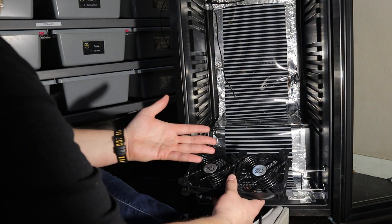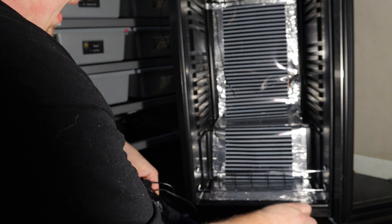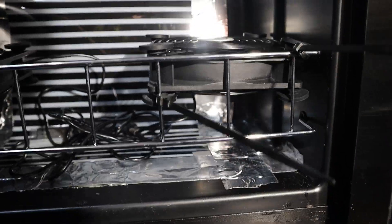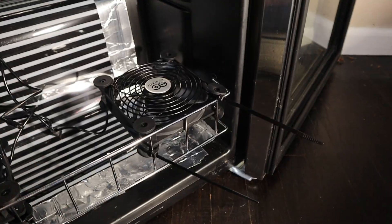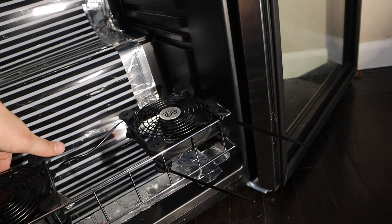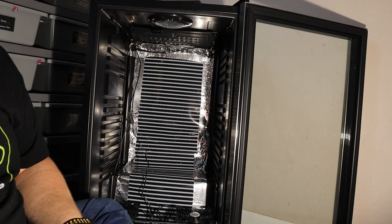The logo is pointing where you want your flow of air, so one will go up and one will go down. I'm going to point the sides with the wires inward so it's easier to run these out the back and conceal them. We've got those fans mounted — they're a few inches off, nothing special, just got them zip-tied in to this piece here. We should get airflow below and above and hopefully circulate that around. Let's run our USB wire for these computer fans right out the back here, plug that in, and let's test run it. These are running quiet, running perfect — we've got no vibration, no rattling.